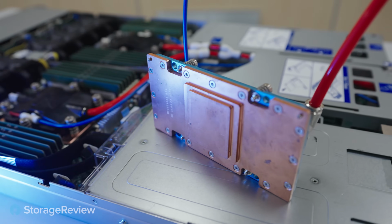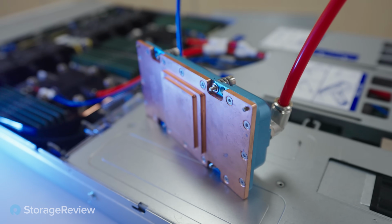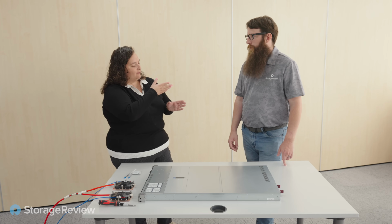The reason we took a different refrigerant is the lower junction temperature the GPUs need to be at. So, for example, H100, H200. Those are hot, but they need to be cooled. Their maximum junction temperature is around 80. So this goes back to us, and the heat flux over there is much higher. So even for the copper part of the cold plate, you have a bigger delta T. The condensing temperature will be lower, so around 43. And since we like the vapor pressure to be around 1 bar, we want to be 43 at 1 bar.